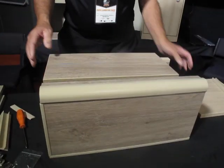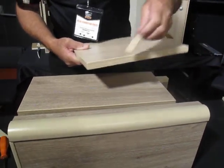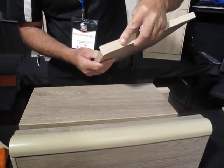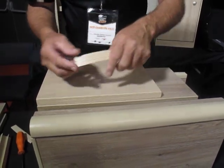The door can be edged with a 1mm edge banding, which can be done with an iron, and trimmed with a craft knife and sanded, so that you are able to put edge banding on all edges.